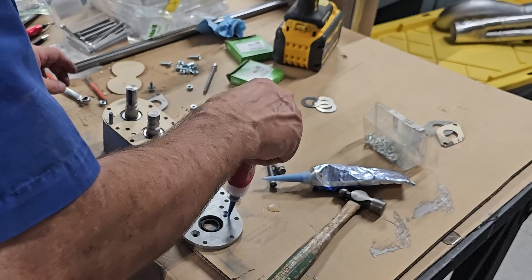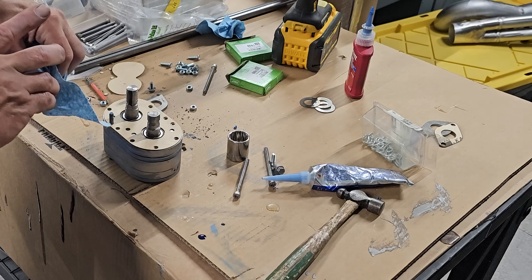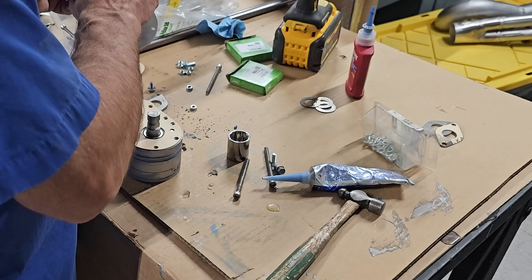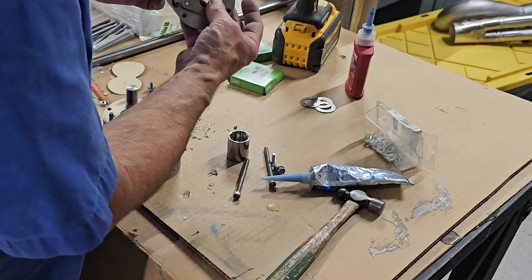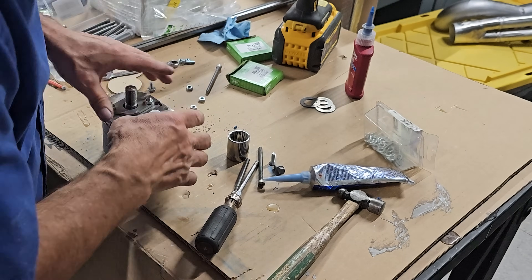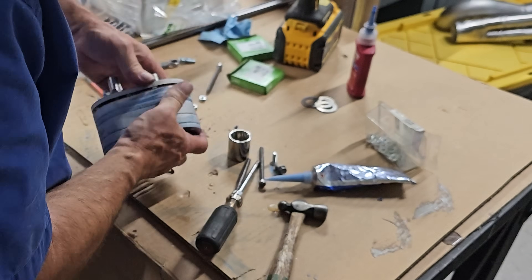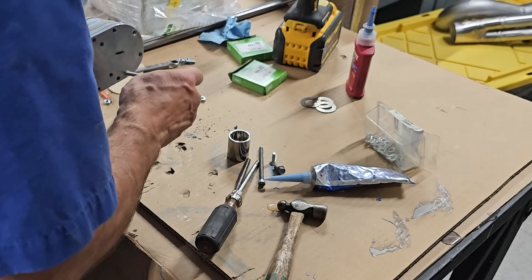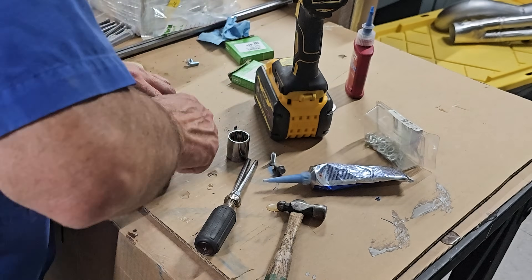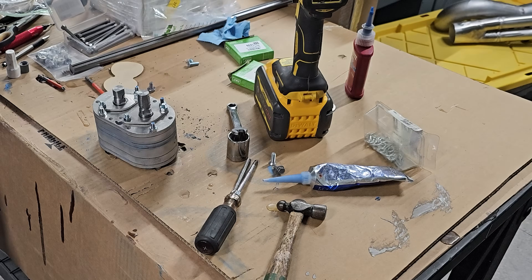Before the last plate goes on, the seals could possibly work their way out. So we created a couple of countersunk holes for some machine screws that are going to go in backwards — when we flip it over, those machine screws protrude down a thousandth or so and press tight into that last gasket. Between pressing tight against the gasket and some Loctite, it'll keep those machine screws from turning should we need to take that retainer off and do any work on those seals. Tap it on with a tiny little hammer — doesn't take much force. Once all components are assembled, put all the machine screws back in and torque everything equally all the way around. Once it feels just right and things tighten evenly — test it, turns great.